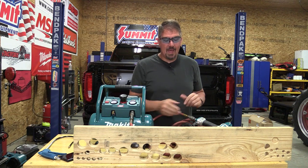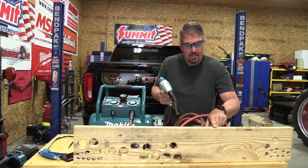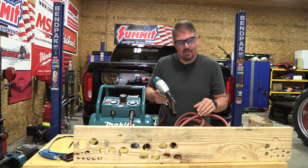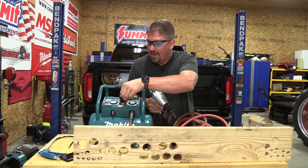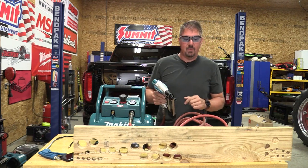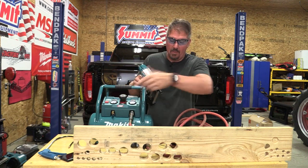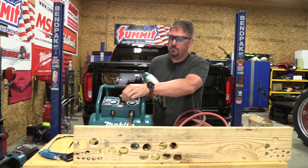And that's not too bad. And you can see, well, you can't see because you're further away, the nails were kind of starting to get a little bit higher, which they shouldn't. I have this set up for 90 PSI. Let's just wait for this to recover again. I'm gonna regulate this up just a hair above. We do have a longer hose.